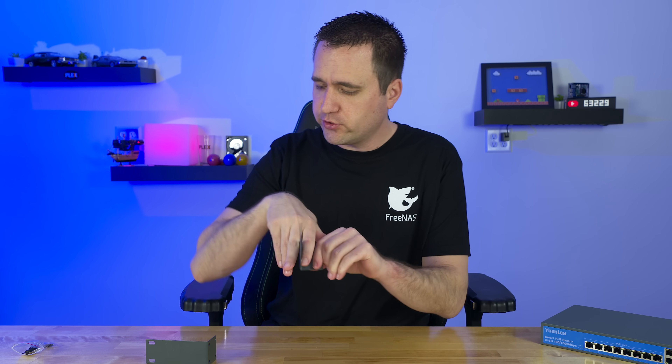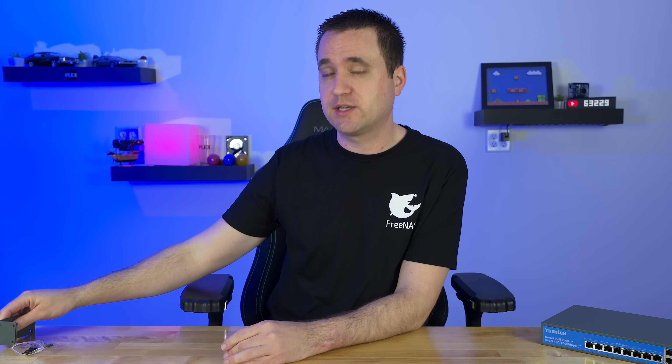Overall, it does have a maximum of 120 watts. So if you're going to use every port, that's a maximum of about 15 watts per port. Since cameras are probably running five to ten watts each, you should be good to go to run eight full IP cameras.